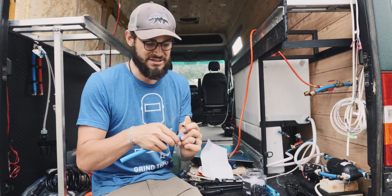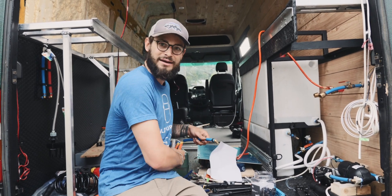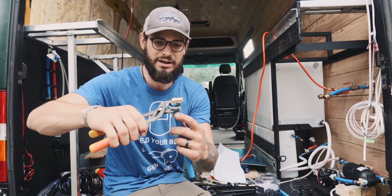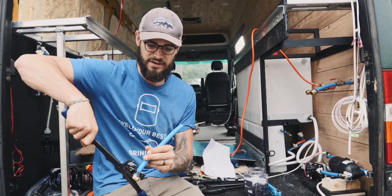Instead — and I was intimidated by this — you basically just use a copper ring around the PEX, attach it to your fitting, and then do a slight crimp with some pliers to prevent it from moving as you bring in your larger crimper to finish off the fitting.